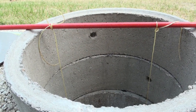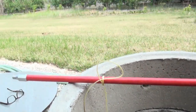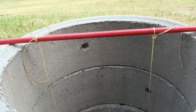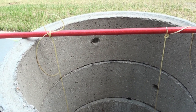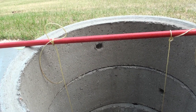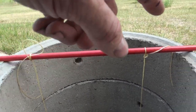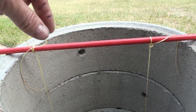What I've done now is I've hung two weights from strings attached to this broom handle, and then I put some marks on the concrete. I want to shorten this broom handle later. Basically I'm positioning where I want the broom handle to be when I hang cords on there. The main float, which operates the pump, I'm not going to be doing any work with during this project. But in the future, I'd like to have this broom handle positioned so I can hang both floats from the same broom handle and be able to slide and position them.